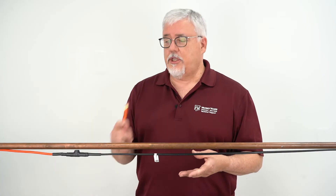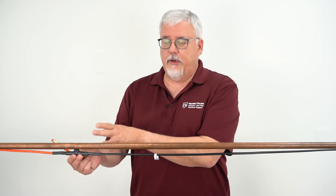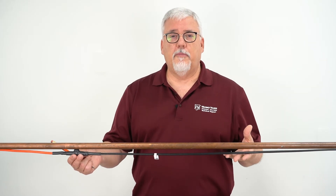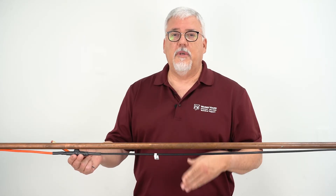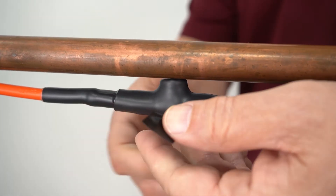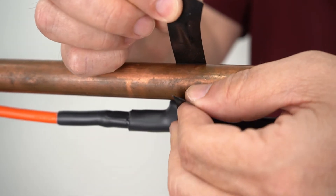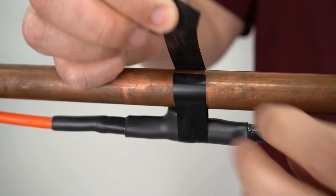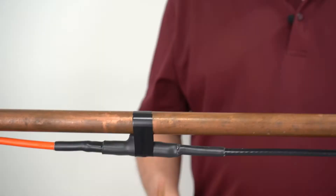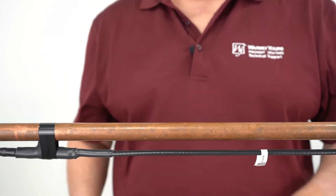What we're going to do is attach the thermostat portion switch first, and then measure every six inches down the pipe to put our tape around to hold it in place. The tape you're going to be using is standard electrical tape. I'm going to tape this in place making sure that it's in contact with the pipe. The heating tape is going below the pipe, on the bottom. Now we're going to measure every six inches from this spot and that's where we're going to be putting tape as we go down the pipe.